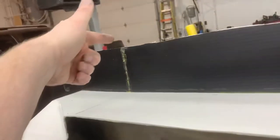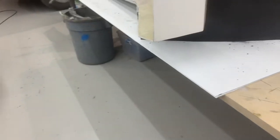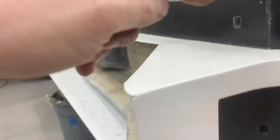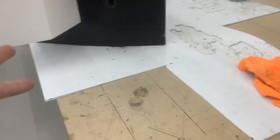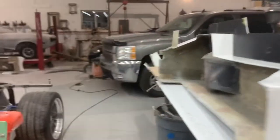The partitions are nice and easy — just one square bit there and one square bit there. Then we'll build the large section in the center because it's nice and horizontal. Because I've got to build this mold from underneath, fiberglass just wants to fall off with gravity. So we'll do the top section first, then turn it on its side to do one end section, then the other end section.